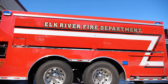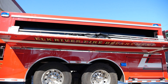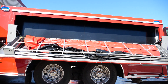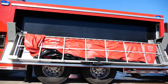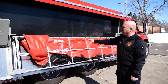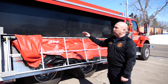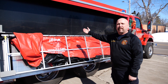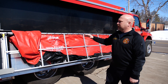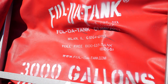On the side here is our drop-down tank. This is usually stored in the upright position. When we pull up to the fire, we're going to drop this down so that two to three firefighters can lift it off, deploy it, and have it in line with one of the chutes to rapidly fill. The pool on the side — what we call a drop tank — is the exact same size as the maximum capacity of the tender itself. Tender 2 is a 2,000 gallon, so it has a 2,000 gallon drop tank; this one is 3,000 gallons so we have a 3,000 gallon tank.